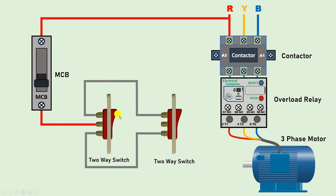You can see how you have to do the connection. After this, from the middle point of the second 2-way switch, connect a wire to the 95 number terminal of the overload relay. Now you must be thinking why we are using the 95 number terminal. The benefit of using this overload relay is that if any problem occurs in the motor, the overload relay will trip and our contactor will turn off. So connect the phase supply with the 95 number terminal of the overload relay, then take the power supply from the 96 number terminal and connect it to the A1 terminal of the contactor. These 95 and 96 number terminals in the overload relay are NC contacts, so we have to use NC contact here.